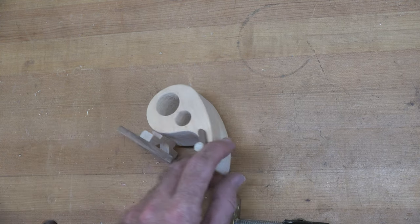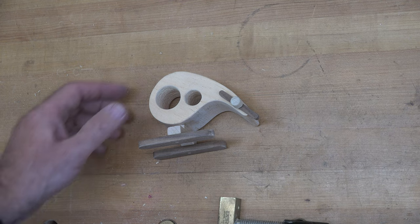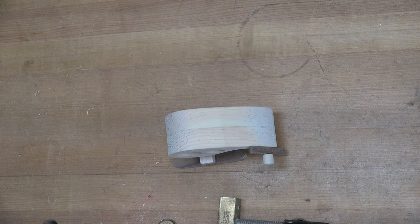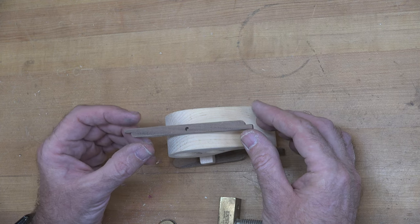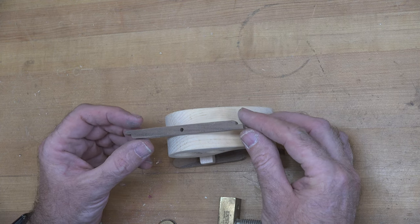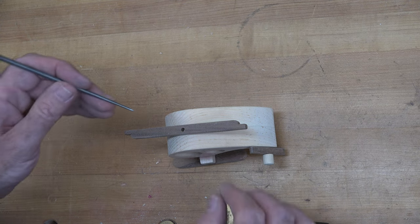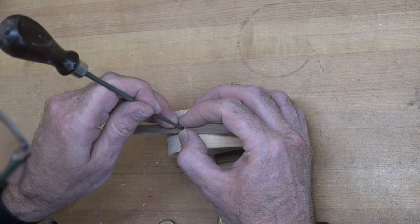Well, the last thing that we need to do with this project now is to mount our main rotor. For that, it's pretty simple. All we need to do is sit it upright, just like this, take our main rotor, center it so that it balances here on the top of our curve. Once it balances, you'll be able to see its position. We will mark that in the center with our awl, drill a 1/2 inch deep, 1/8 diameter hole, and then we can mount this.